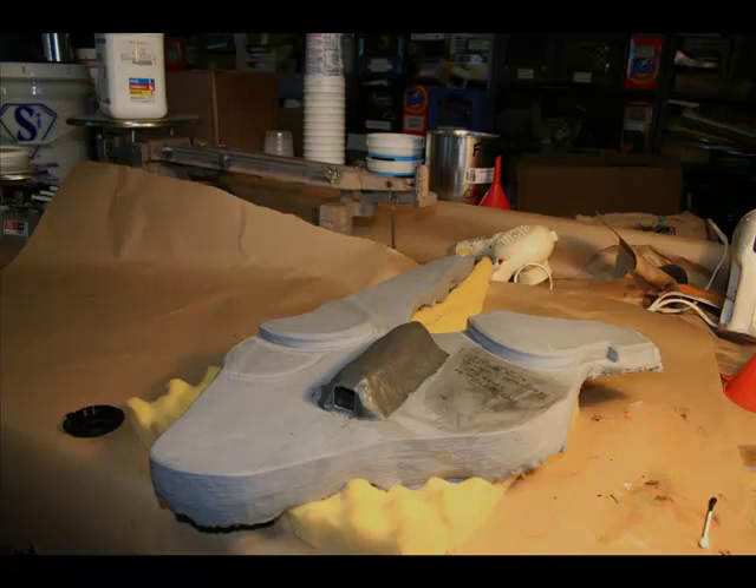This shows the underside of the cast. You can see those two islands where we used the horseshoe dams, and in the middle is the receiver for the armature, held on with a product called JB Weld, which is a steel-filled epoxy. The bond with urethane is extraordinary — the urethane will break before the bond does. So for attaching armature, it's perfect.